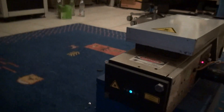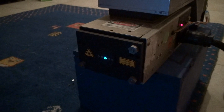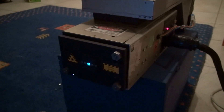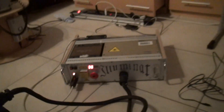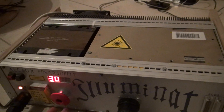Okay, it's still in the warm-up phase. Don't look into the beam. On the camera it's looking brighter than it really is. The laser has the power of about — if you really ride it hard — about 80 to even 100 milliwatts. But you better run this at about 50 milliwatts. You don't want to stress the tubes. Now I think it's powered up. It's at 30% of the power — not milliwatts, but percent.